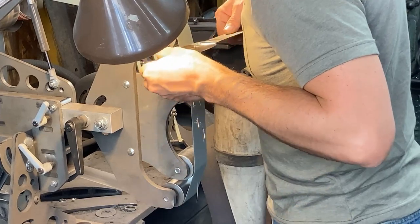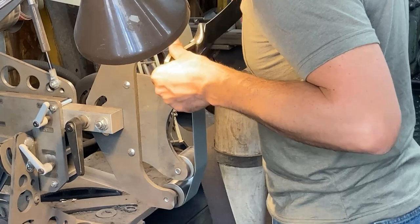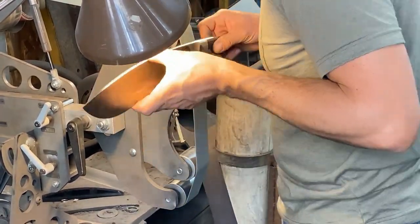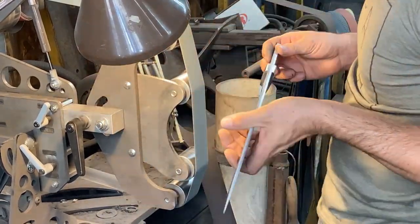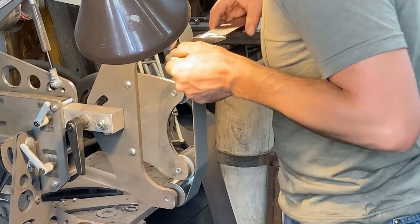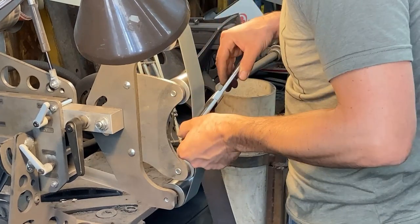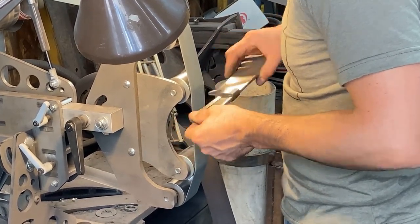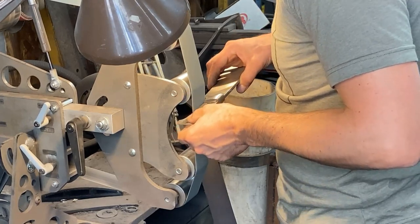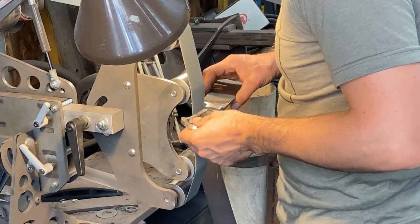Now we switch to the Gator, that's a 3M Trizact CF A100. It's about a 180 to 200 grit finish here. Very good for getting those ceramic belt 120 scratches out. And this sets it up well for a Gator A45, which is about a 400 grit equivalent. And we are just getting down to the finished look this time.